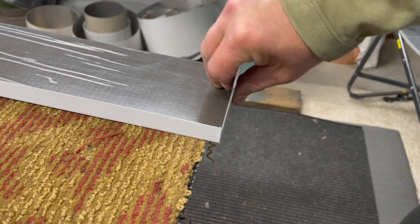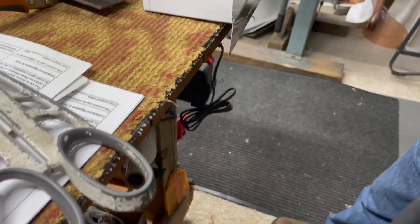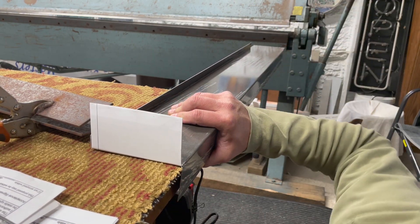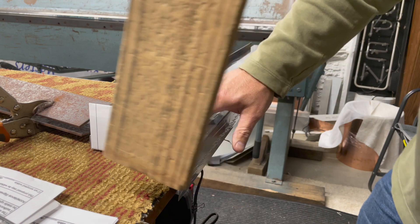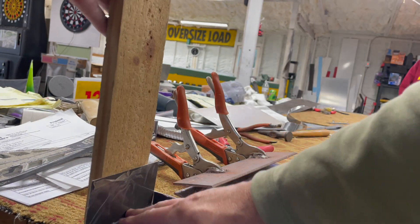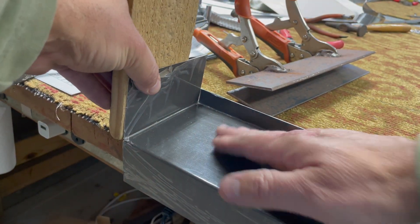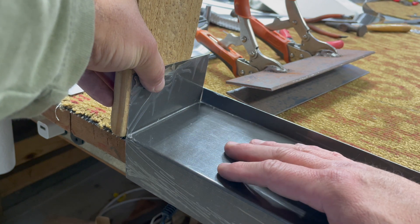Now when they set this inside the door jamb before they put the door in, it's going to fit in like this. The inside of your door frame — your two by four will be up like this, and then this acts as a nailer to nail it from the other side. You slide it in there, get it nailed in, then caulk these corners, and slide the door right on top of this. That's what keeps your door jamb waterproof.